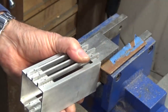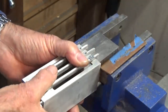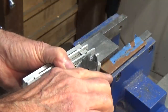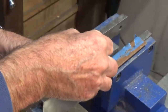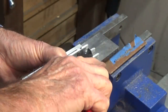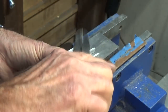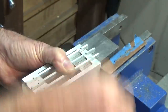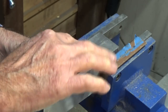And the next step is to cut the rivet off so that we've got the correct amount to go down into the countersink. So I'm just using a small washer and a pair of flush cutters. And you sort of have to experiment with the amount of material that you've got protruding there to hammer down